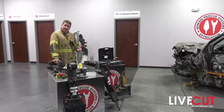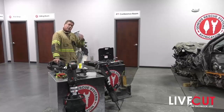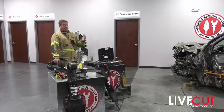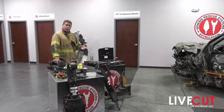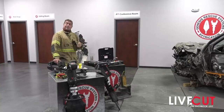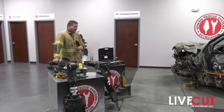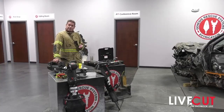If you have gasoline power units, make sure the gasoline is fresh, make sure the hoses are in good condition, make sure the tools are clean and ready to operate, which means when you get back from your last extrication and it's rainy or muddy or wet. Sorry, this is live, so I'm probably going to jack this up a couple times just so you know. So it goes. You want to make sure they're clean and ready to function, okay?